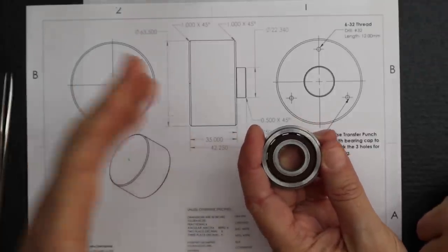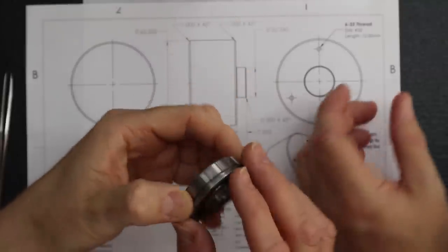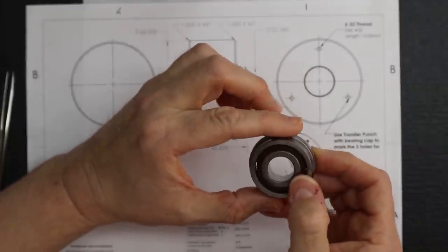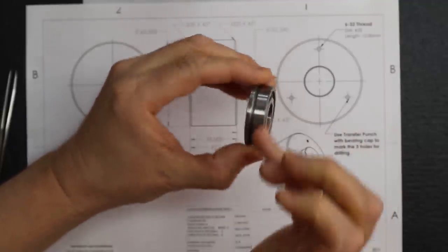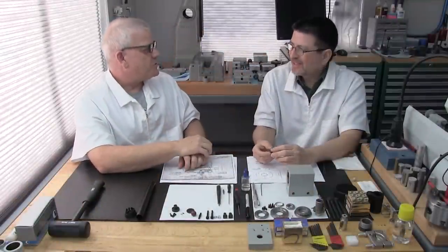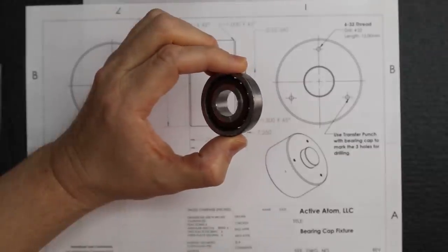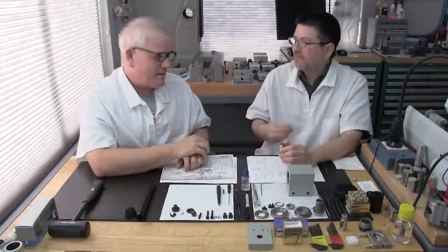The reason I forgot is because Lance was the one who did this. Before we machine this bearing, this is the old flange bearing, but when you unpackage the new bearing where you're going to machine the groove, I'm not allowed to have it yet because we're not ready to use it. You don't want to take a bearing like this, open, on the lathe and start modifying it or turning your groove. Not when I'm over here using protocol on it to keep every little piece of lint out. We certainly don't want chips from the lathe in there. Because if chips go into the bearing cage, that's a really bad thing, because we feel that you can't adequately clean a bearing.